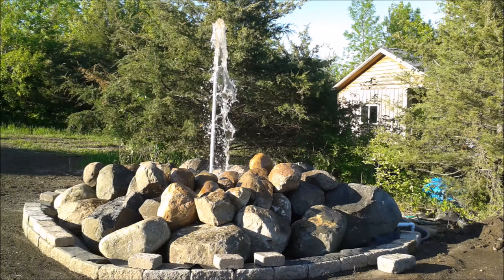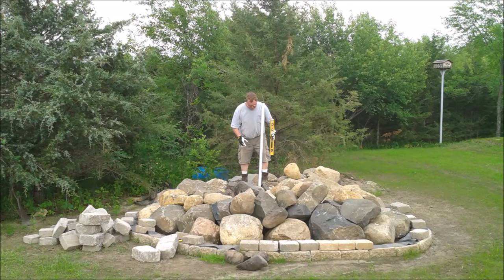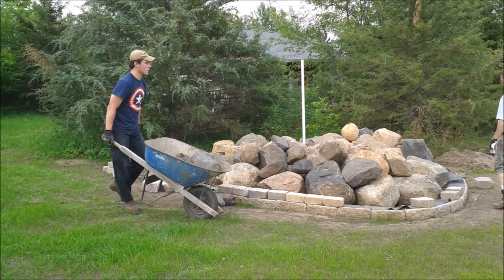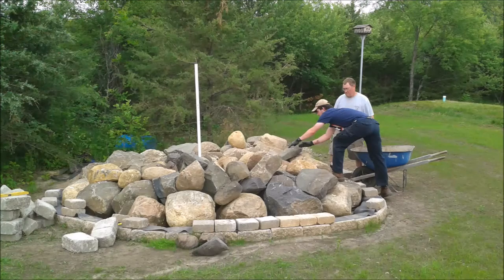This photo shows that the water slopes from left to right, so all the water will run into our holding tank. The rest of the rocks can be moved by hand, but with the help of a wheelbarrow and another person. It's important that we check to make sure our pipe is level the whole way through to ensure the rocks haven't shifted. The rocks got lighter, but it was still important to have two people and a wheelbarrow to place them precisely. Always be sure to wear gloves when working with rocks — sharp edges can hurt your hands.